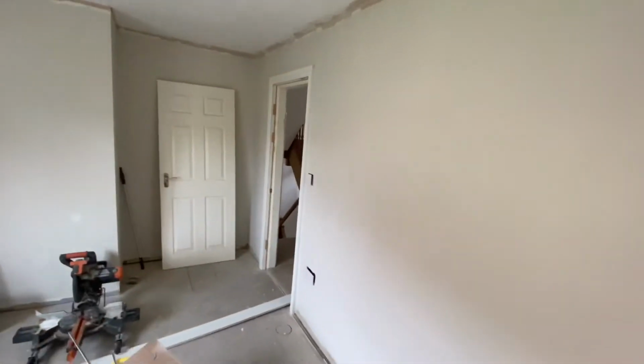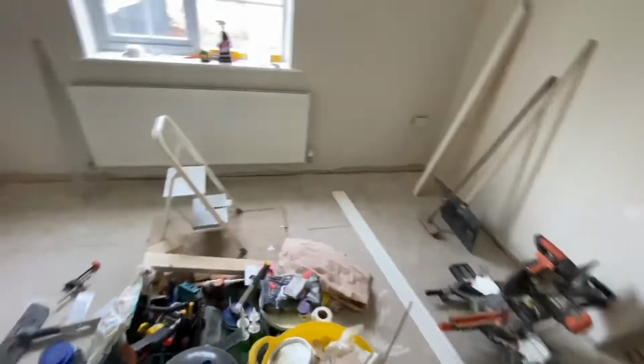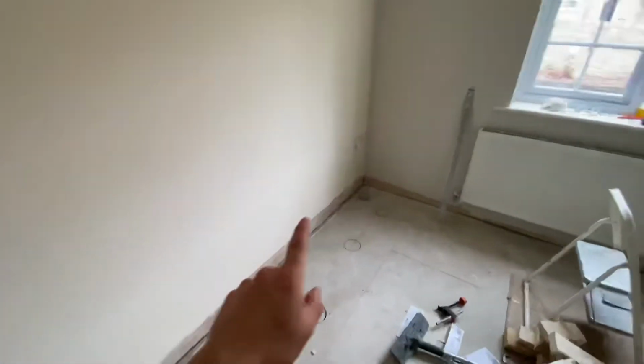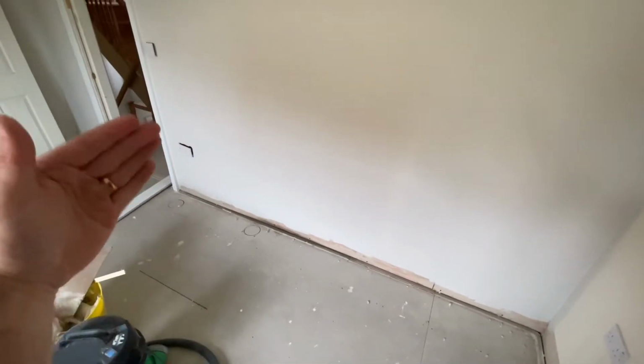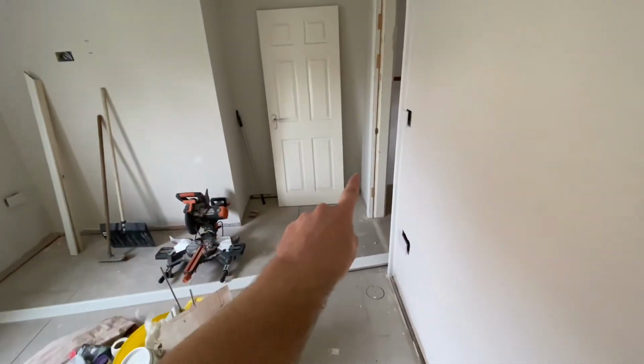Now what that's allowing me to do is get the architrave on, and then it's going to let me get the skirting on. So I've decided I'm going to cover the skirting in this video as well. I'm going to crack on, got my chop saw ready, and then I'm going to put a full piece in there, just wall to wall, and that piece will be scribed at that end, but just cut square at that end. This one scribed there, flat cut at that end, scribed and flat on that one. That'll be a flat piece, and so on. So we'll work through, we'll get going.